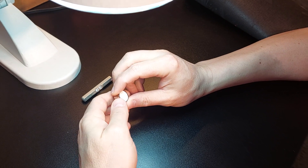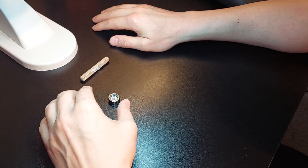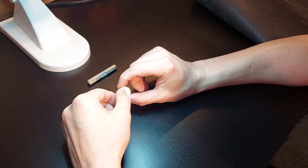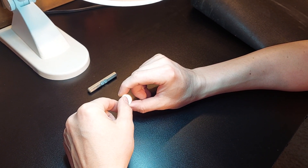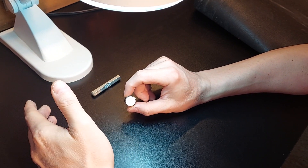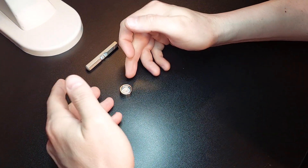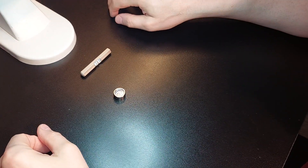You can see how this is made — it is just a beautiful unit. You can attach these in a multitude of different ways. You can use tape, though I'm not a big fan of that mainly because the tape can give on certain access points. You can certainly use magnets. You can use anything you want to attach this with. If you were to actually try to bond something to it, two-part epoxy works extremely well. Keep in mind, if you use JB Weld Epoxy, it has steel in it so it would actually flow towards the magnet. I prefer to use a silicone bonding agent like a silicone gel — that works extremely well. When you do place a magnet on this unit, you want to make sure you're doing it at a level reference point, keeping the level as level as possible when it's being attached so that you know everything is correlated.